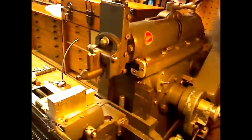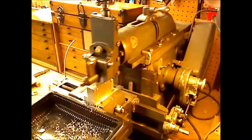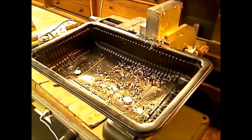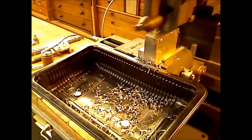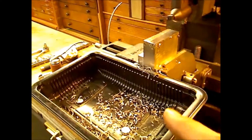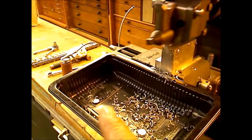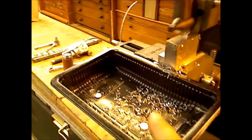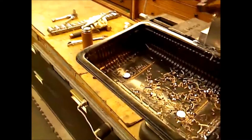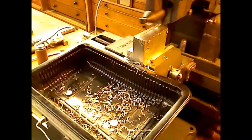Get the light out of the way here for you. A little chip pan — only because I don't like chasing chips. Got a couple of pieces of steel in the ways there. There are no T-bolt slots, and then a couple of neodymium magnets holding on this little thin old plastic tray. It catches about 99% of the chips.